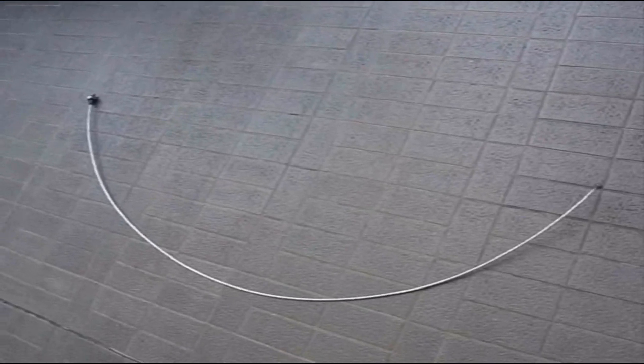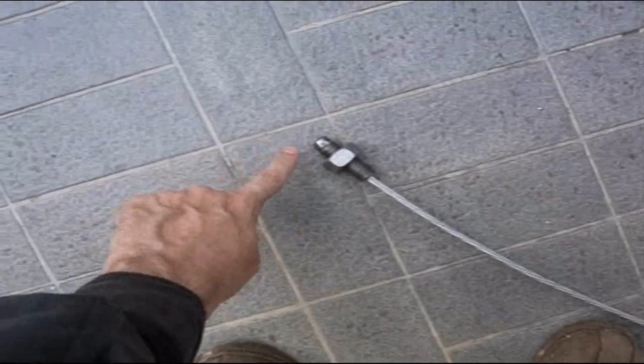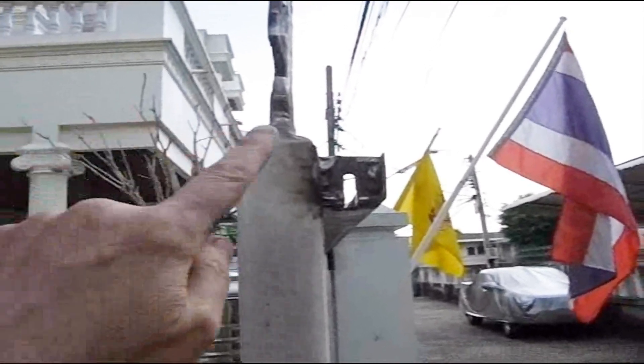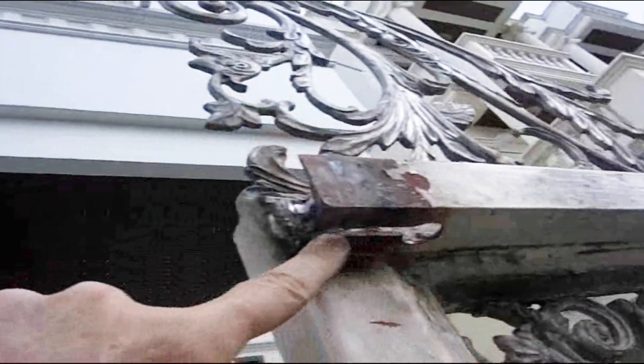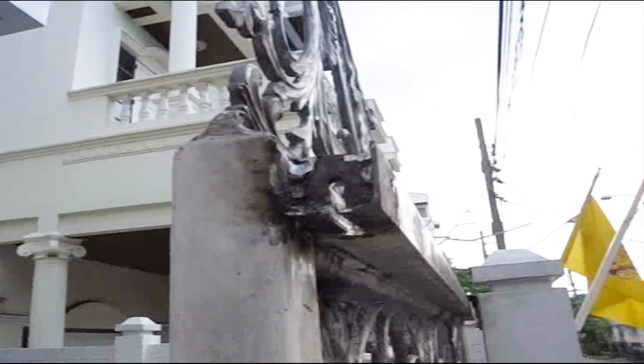This is the safety cable that goes in the railing. Here is one end piece — this is welded on there, and I advise having a professional do it. Here is the other end, where the cable is tightened, and here is the other piece that was welded on. One end of the cable goes in here — that is the rounded end. It goes into that slot, enters through this hole down here, passes up through the slot, and will stay right here. The ball on the end will keep it from pulling through.